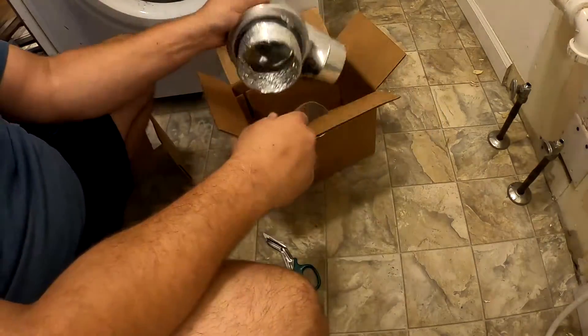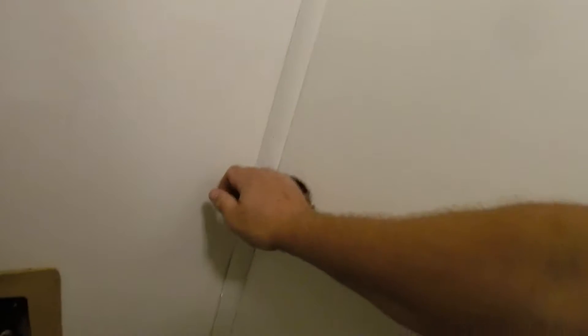I'm excited to try this and to have no more lint in my bathroom. So let's see how it goes. We're back — I had to switch cameras; I've got my other one doing a time-lapse on a roof install. We went to Home Depot and got a new exterior roof vent with a flapper door because our old one wasn't working. Our old one had louvers and they were staying open, so in the winter if you left the dryer door open you'd get a nasty draft. And just because I had it out, I got new heavy-duty semi-rigid duct. That's pretty much what was in there, but since we're replacing everything else new, why not? It's clean, it's got no lint on the inside, and I think it might be just a little thicker wall than what we had.